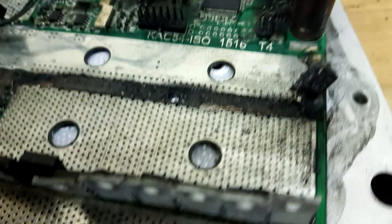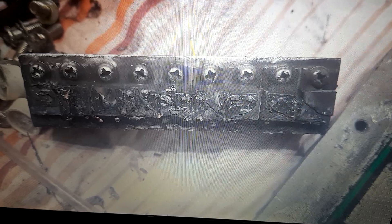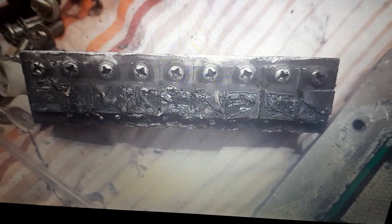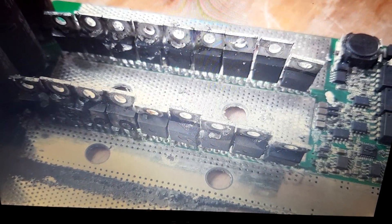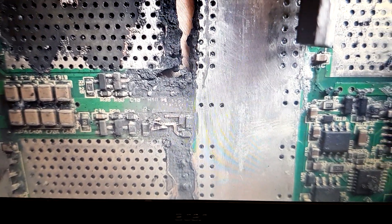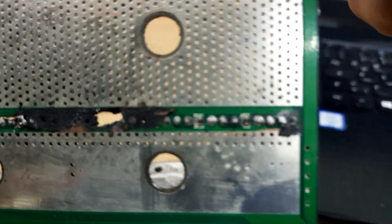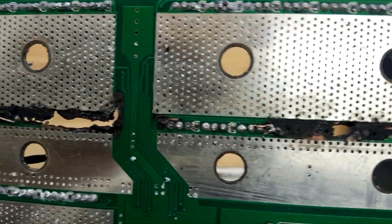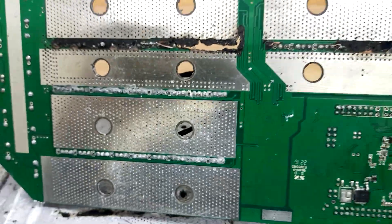Talking about the destruction, you can see it here: a massive meltdown. No pins or legs of the MOSFETs were left over; there were even drops of molten aluminum inside the housing. I was not able to repair it because there were holes burned into the PCB — structures necessary for controlling the MOSFETs, like the gate control and gate resistors, simply disappeared. Rebuilding that structure is too critical; maybe it would last a couple of hours but during heavy duty it won't last long.